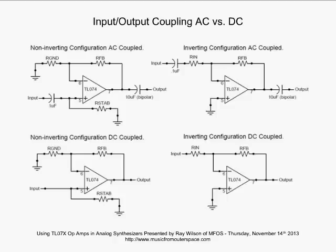What we see is we've got that capacitor going into the non-inverting input. We have our stabilization resistor, which I highly recommend you always use. You could make it like 1 meg, you could make it 100K. But bear in mind, the capacitor and resistor will form a high-pass pole. That's why I typically just make our stabilization 1 meg. Then that pole is so low, you don't really care about it. You're not cutting off any frequencies you're interested in.